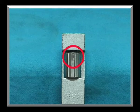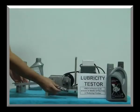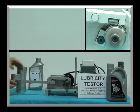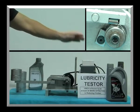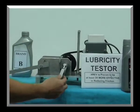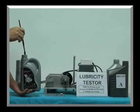You can see from this zoom-in that quite a large abrasion has been made on the fixed bearing. Let's undertake the same test with the oil from Brand B to see if it holds up any better. Switch on the device and apply the one kilogram weights again — one, two — and the rotating bearing seizes up again after just two weights. The zoom-in reveals that a similar size abrasion has been made on the fixed bearing.